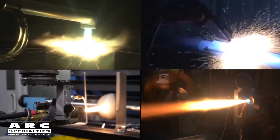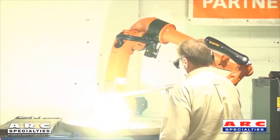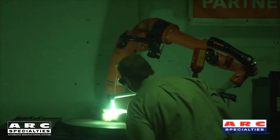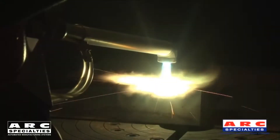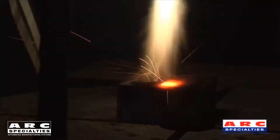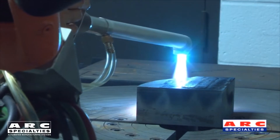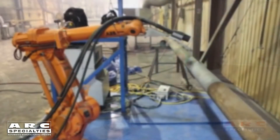Today we're going to showcase four different thermal spray processes. The first one is an oxyfuel flame spray application. We're putting down a chrome-nickel-silicon-boron hard facing material directly onto the workpiece using an oxyacetylene flame. This material can also be applied with an arc. The advantage of a flame spray application is we have zero dilution, so we maximize the hardness of our overlay material.